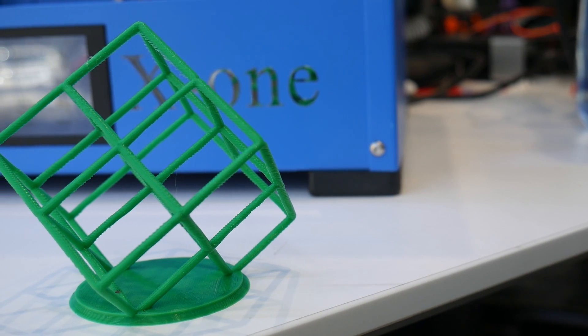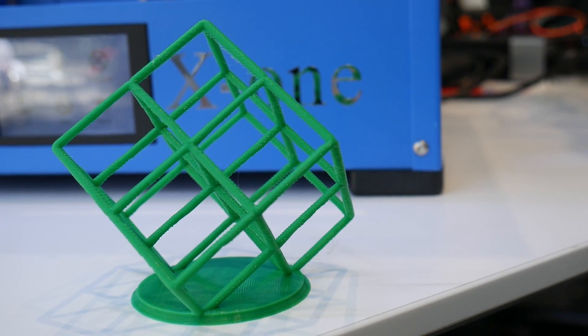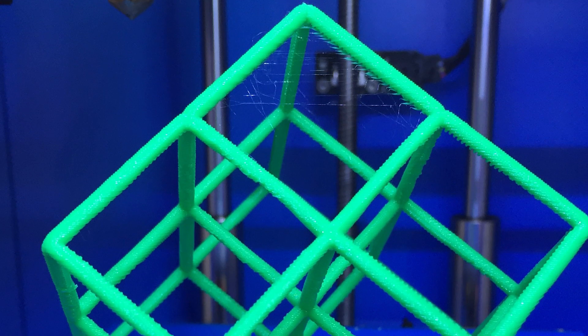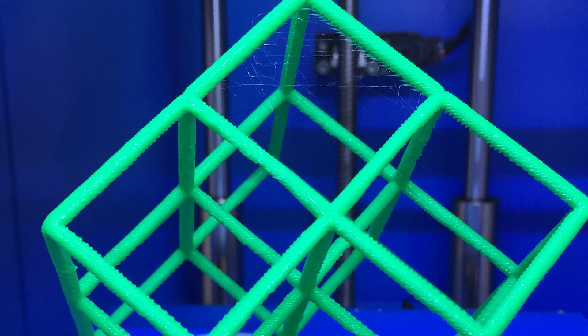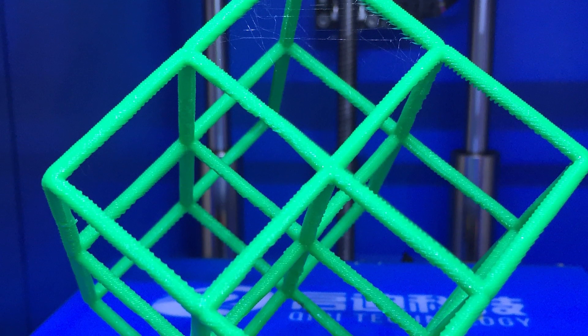Alright, let's get into how this thing prints. To start, I threw my lattice cube at it. So, 0.2 layer height printed at 60mm per second, although Simplify3D does slow down significantly as the layers get smaller. The top has a little bit of stringing as the plastic had less time to cool, but overall it's a really decent result, and a little bit more tuning and I reckon I could get rid of that stringing at the top.